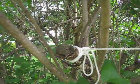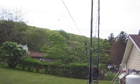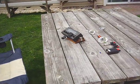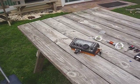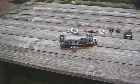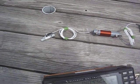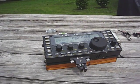This one here is only about 5 feet above the ground so it's not very high. And the other week I worked with this antenna — this exact setup and a KX3 at 5 watts — Delta Lima 1, Delta Golf Sierra at 5 watts into that antenna at that elevation. Sergey gave me a 579. I'm on CW. I explained to him exactly what I was using and how high the antenna was, and he came back to me and confirmed again I was an honest 579.